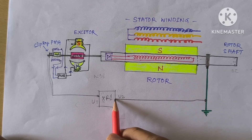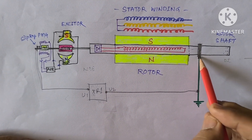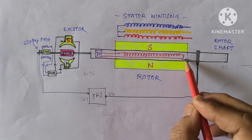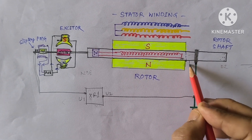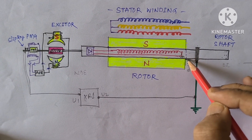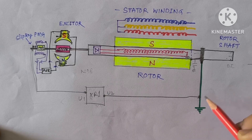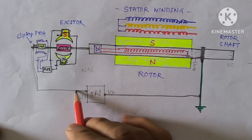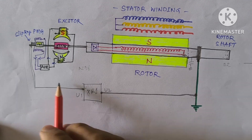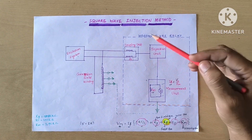The U2 terminal takes a parallel feedback tapping from the same path. The outer portion of the rotor is also grounded, and a feedback from this ground is also taken to the relay. During normal operation, a capacitance forms between the rotor insulation and the grounded rotor body — called ground capacitance. When there is a fault or insulation failure, fault current flows through the rotor body to ground, and feedback is given to the relay. The injection side and the feedback side are compared, and the relay continuously measures the insulation resistance of the rotor.